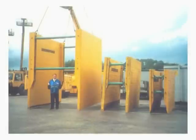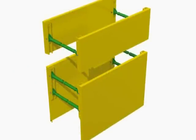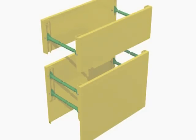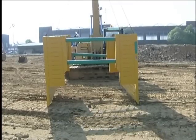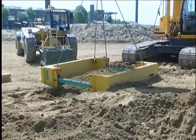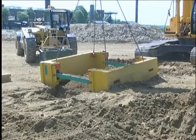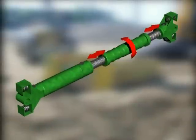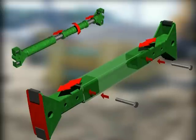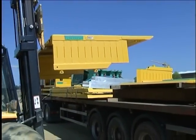Boxes are available in a wide variety of sizes and weights. They comprise of a base box, typically around 2.5 metres high, and up to two top extension boxes for deeper excavations. A 360 degree excavator is required to handle all boxes except backhoe types, particularly as large pulling forces can be required to extract boxes in cohesive ground. Two types of strutting systems are available: a fully adjustable strut with a screw thread arrangement, or a pinned incrementally adjustable strut known as the multi-box strut. The units are usually delivered to site broken down in component form.